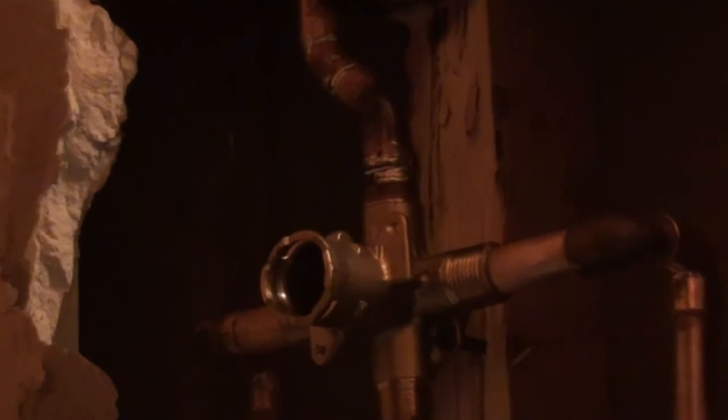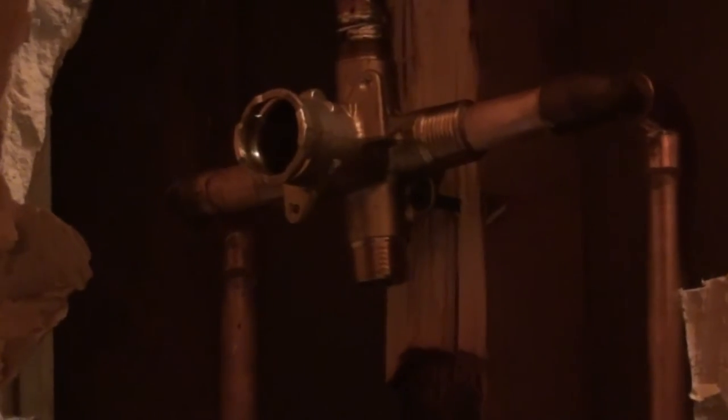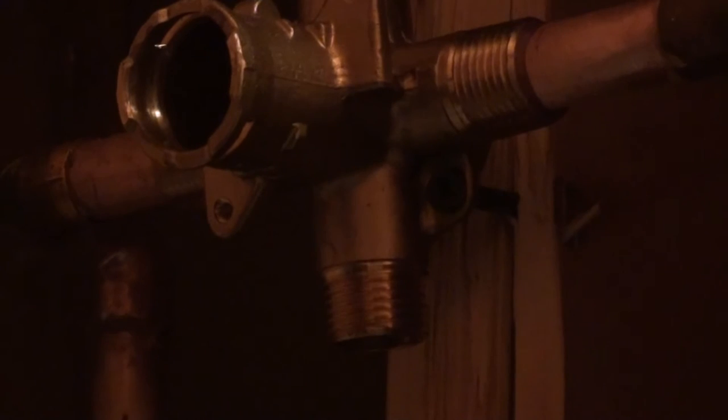Joint, it's because I was trying not to put too much heat on my valve body because I chose to leave my cartridge in. So there are a bunch of benefits to pulling that cartridge out. Try to readjust here for you. See if I can zoom in a little bit. See if you can see the solder suck on in to this fitting.